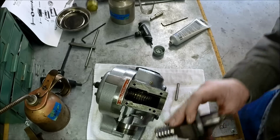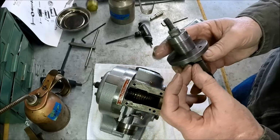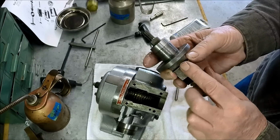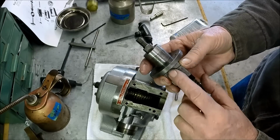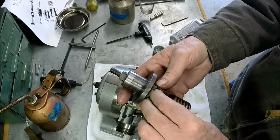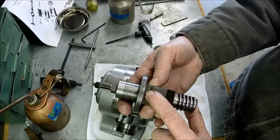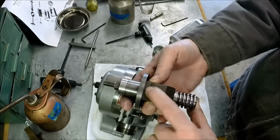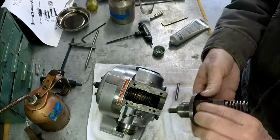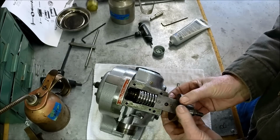But let me see if I can show you guys. So we got a little tiny counter bore in here. The spring fits. Okay, and then the wiper goes on top of it. Like that. Because I got it upside down. Let's flip it over. I don't think it makes any difference. I noticed it had the little mark from the spring. So this worm assembly can pivot so that you can release it and go freewheel and also adjust the backlash. So this little guy here keeps the bottom closed off so chips and dirt and such don't get in there. So now, to get that in there and not have that pop out, let's see,